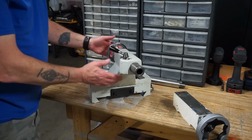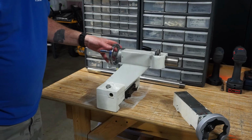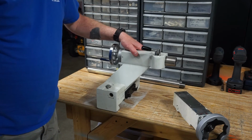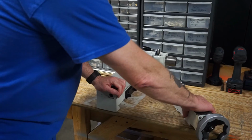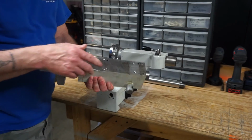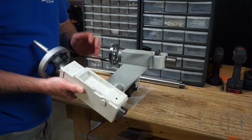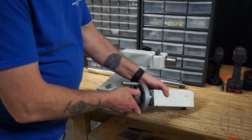And here we can get a good shot of the actual tailstock that you can purchase at Tormach. You can see how big it is, and it's very, very hard to move. It does function once you get it mounted on there, but as I stated before, every time you move it, you got to redial it in, and it's just a royal pain in the butt to do that. That's why I went to the other system, and here was the Generation 1 tailstock. This was a used one that I got, and basically took a facing cut on the top, drilled the mounting holes, and then machined off everything else at the back side. This one worked really good, but it came off of a used trade school machine, so I wanted to purchase a new one before I finally started doing the barrels.